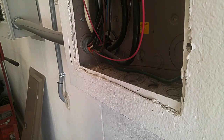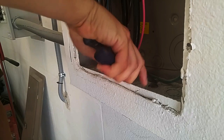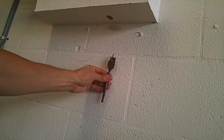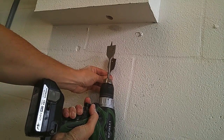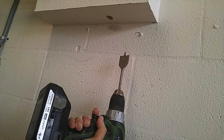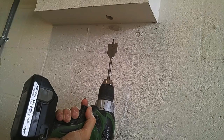There's a 2x4 under here — I'm going to have to drill that out. It's not a big problem, but it will complicate things. The hole is six and a half by one and five-eighths. My original plan was to use a smaller bit — the conduit size — to get through the drywall and then slip the larger bit behind it to go through the 2x4. That would allow me to attach the fitting securely to the box. But the drywall hugs the 2x4, so I'm going to have to use the larger drill bit and just fill in the hole at the bottom.